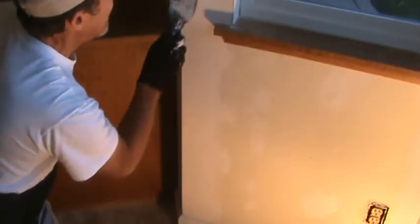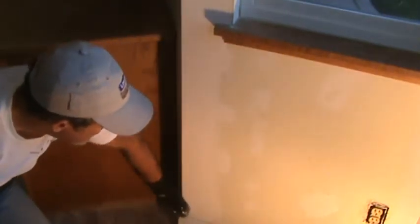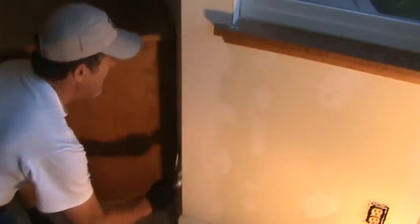coat, because then if I have a little bit of a ridge, that means I have to put more sheetrock mud on. And what I'm trying to achieve is only putting a tight skim coat on there, okay? Alright, so check out your patches, scrape them down, and get ready for the skimming. You know, it's not going to take you very long. Just get in the habit of doing this before doing your skim coat.